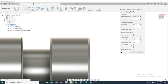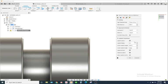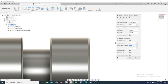See, on the finish pass, it has lead in and lead out. On the roughing, I guess they changed that. They'll probably do away with that, because they'll probably find a lot of machinists don't like the angle approach. They want lead in, lead out. You always want to give a programmer more control over your toolpath. Okay, so we might be kind of screwed on this. Let's see. We'll put this at 90 degrees.